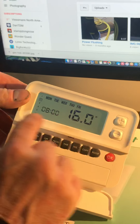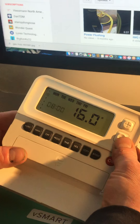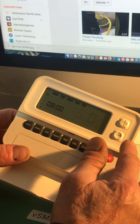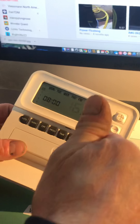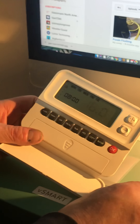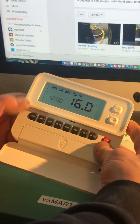It then goes down to the second program — I have it set to go off at 8 o'clock, so I press OK. At 8 o'clock I'm setting a minimum temperature: I don't want my house to go colder than 16 degrees while the heating is off. So it would have to drop from 21 to 16 for the heating to come on, and if it did come on it would only maintain a maximum of 16 degrees until the next program. The third program comes on again at 12 noon, still maintaining 16 degrees.